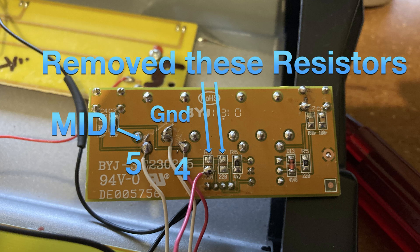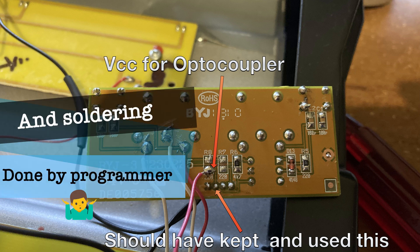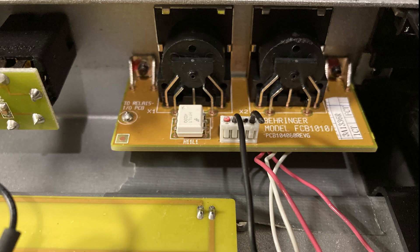Pin 2 is the ground connection. This extra connection is 3 volts from the Teensy to drive the opto coupler for MIDI in. It would have been easier to keep the bottom connection shown — too hasty with the wire cut, I'm afraid. The MIDI out lines from the Teensy connect to the new resistors soldered under this second board, before connecting to the MIDI out socket.